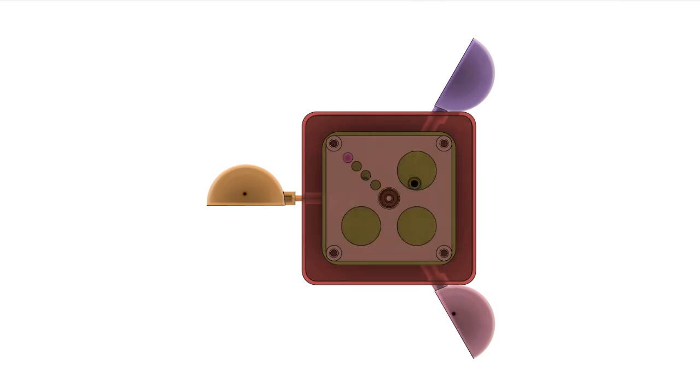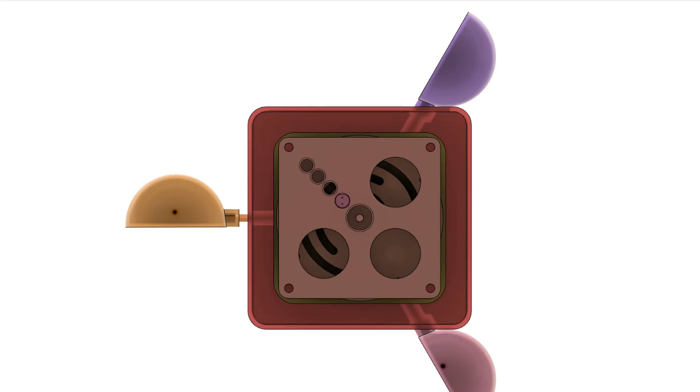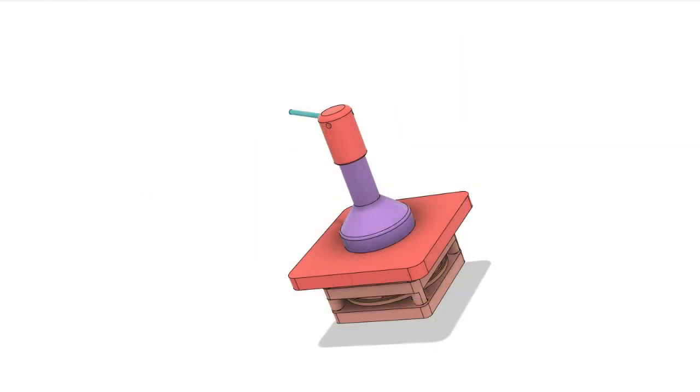Let's remove the slotted disc encoder wheel used on the anemometer. And for our absolute encoder, we're going to need more phototransistors and infrared LEDs, so let's add them now. And we've now installed the slotted wheel that we're going to use for the absolute encoder. We've got a number of slots in our absolute encoder wheel, and depending on the position of the wheel, some of our phototransistors are going to be either exposed to infrared or not. And those 4 phototransistors are going to produce a bit pattern which is dependent on the wheel's position. So let's reinstall our infrared LEDs now. And we don't need the parts used for the anemometer, so let's get rid of them. And here are the wind vane parts.